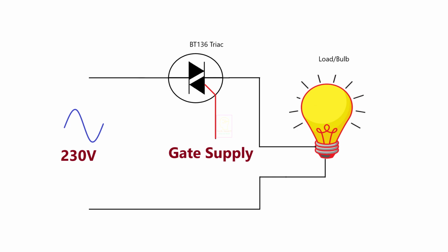But in reality, it is not resisting the flow. Instead of that, it is clipping the AC wave and thus reducing the voltage. That is why in earlier fan regulators, you can hear a humming sound at low speed because of the presence of DC that was formed because of clipping.